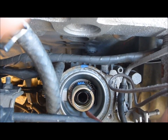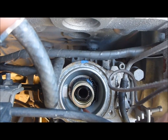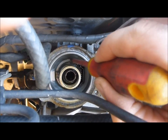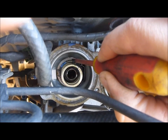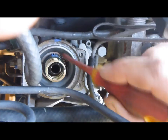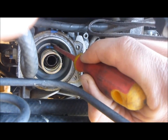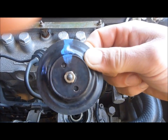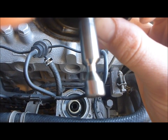Very carefully, using the flat blade screwdriver, we are just going to give this a turn clockwise. Now we are going to reseat the diaphragm from its original position, turning it clockwise 90 degrees, so this widest part here is towards the front of the engine.